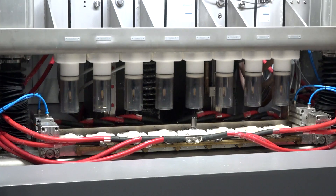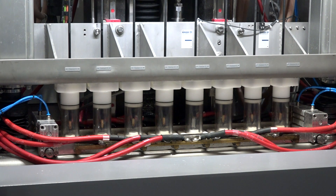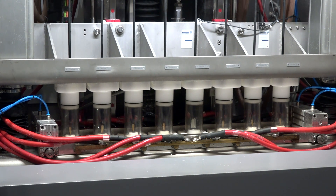You can go through deburring these in various ways, or you could just drill a hole with ECM. When you drill a hole with ECM there are no burrs, so the entire deburring operation chain after your initial processing is completely eliminated.